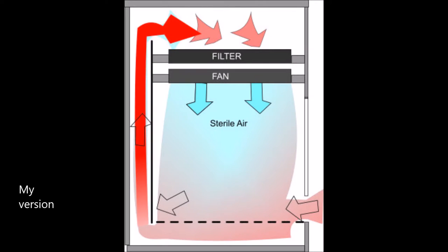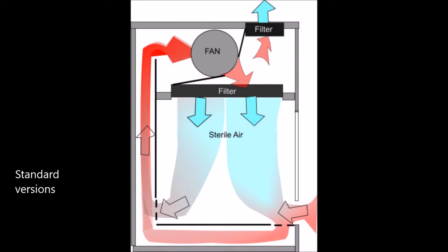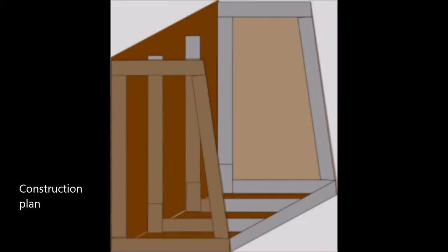For the design, I decided to diverge from the standard format. In my design, air goes through this area here — the red air is not sterile, it's pulled through by a fan using vacuum, then goes to a bottom perforated panel and recirculates. Commercial units push air through a filter instead of pulling it — there's turbulence, they shoot some air outside, and flow only goes from the front and back with a gap in between.